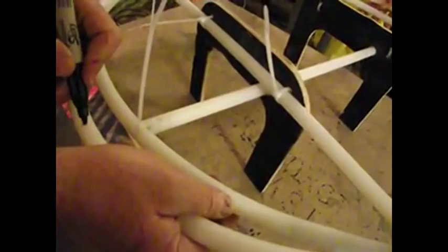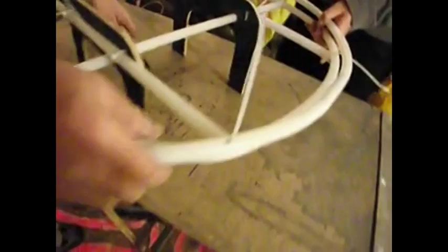So there's also the two holes for the cross brace. Alright, forgot those. Alright, so keep it circular for ease of handling. So we've drilled a 6mm hole in this all the way through and then done that at each end. And then done that on all of them.